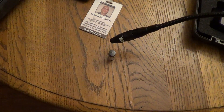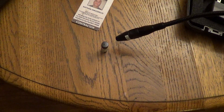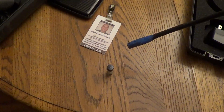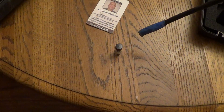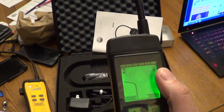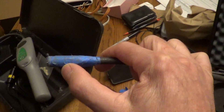This is phenomenal sensitivity. I have no problem finding leaks — seeing which way the wind's blowing. Back to the FieldPiece. One thing I'm really interested in is how squirrely this is. The FieldPiece is great — you're not going to miss any R-410A leaks, but it's very squirrely. It gets a little bit better with painter's tape wrapped around it.